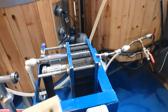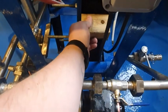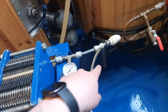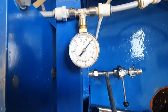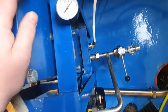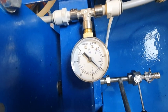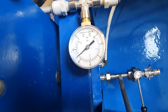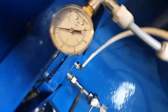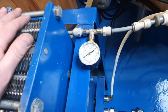We've got the whole assembly put back together and we're nipped up on most of the places. The spacing has worked out perfectly at 92 mil. I've just hooked up this little pressure gauge - which I normally use for testing pressure on keg lines in the pub - it's got a John Guest fitting for release on the end. I've run water through it so there's very little air in the system. There's a little bit of air bouncing somewhere but it looks like we're settled in at three bar. I'm going to turn the valve back off again and we'll come back in 10 minutes and see if we're still at three bar.